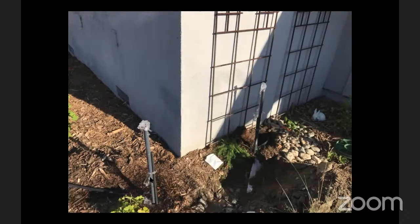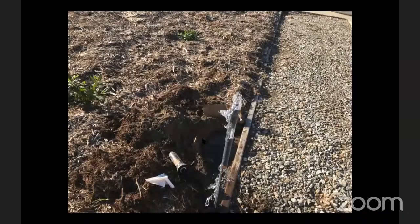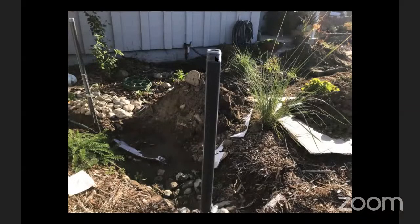Now, because that's going to allow a lot of water to go out, most of the time water is not going to gush out of all of them at once. It might gush out of 3, 4, 5 of them, depending on your landscape. So keep an eye on which ones have flushed clean water out. Then you'll turn off your water, and put the sprinklers on the ones that have been flushed. If you need to, you can turn it on again and make water gush out of the rest of them. Depending on your site, it'll sometimes take 3 or 4 rounds of flushing, putting some sprinklers on, and then that lets more water flow through elsewhere in the system, and then you put more sprinklers on.